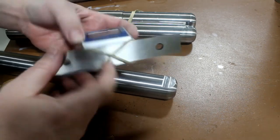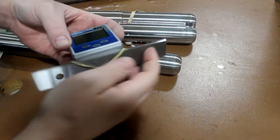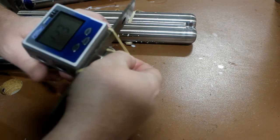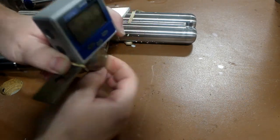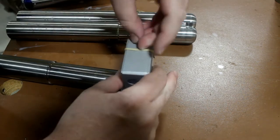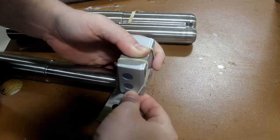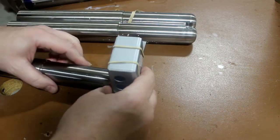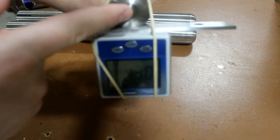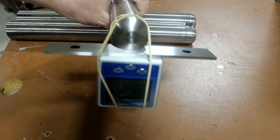I've got a rubber band twisted on a parallel. This is magnetic, but the stainless isn't, so this just gives me a bigger surface area. Bring the rubber band around and down, and to keep it tight, bring it up around here. That keeps itself flat with the flat, and I'll go ahead and show you putting it in the machine.